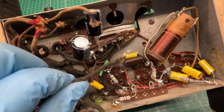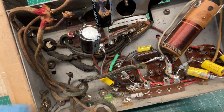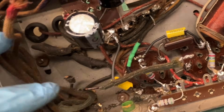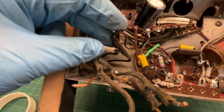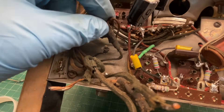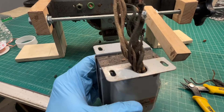For those that are new in the hobby, just take note of this — the reason I like to pull out these old transformers: in most cases you can just see how brittle and used up the wire is. Digging around, one more conductor that's been taped over going back to the third spot left to right on the terminal strip — that's going to be the primary of the transformer based on where I had my temporary line cord connected. One power transformer removed.